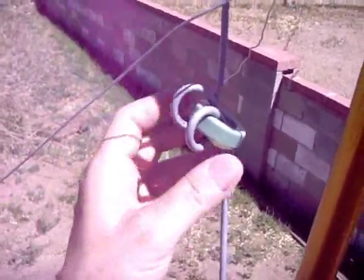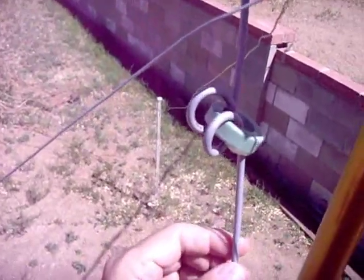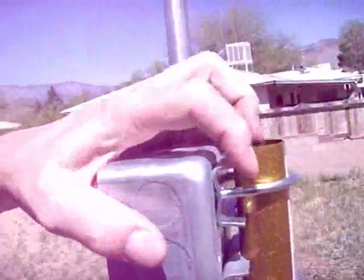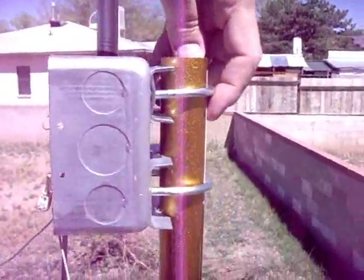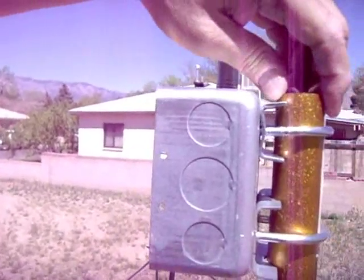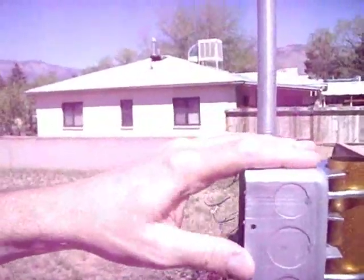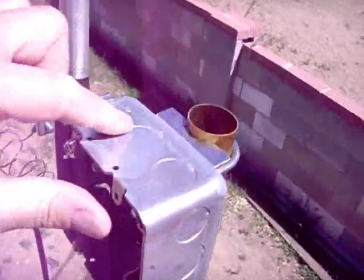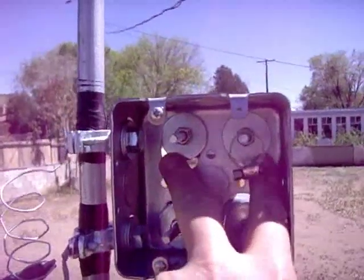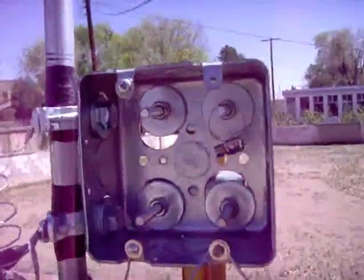I used just a basic toroid — doesn't have to be anything fancy. That's probably not even necessary because we have ground radials on this, which in this case I made from some galvanized wire with plastic stakes that go in the ground, used for fencing. I have all three of them. Now a little bit about the electrical box — I found at the hardware store some basic U-bolts with clamps. The idea was to get an electrical box and drill as few holes as possible, using the convenient knockouts. I knocked some out and put big fender washers inside to give it backing so the hardware wouldn't go through the holes.